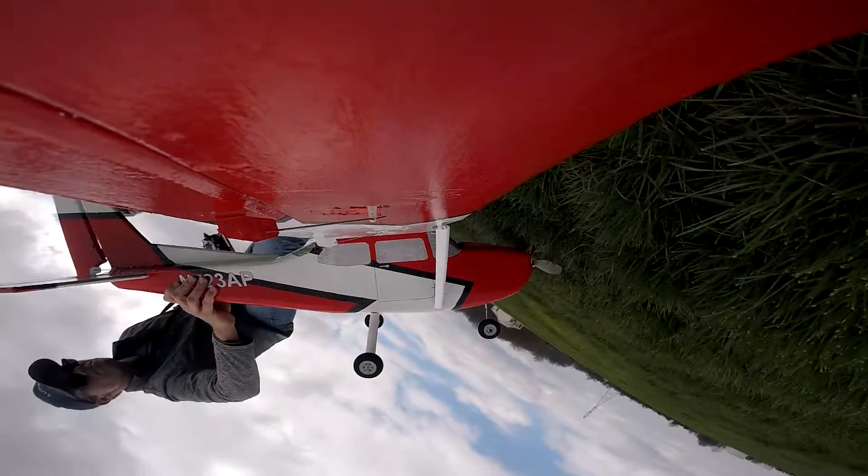With all that extra weight, the plane has to come in pretty fast to land even with the flaps down, making smooth landings trickier. But overall it looks pretty good in the air and flies decently. With the 5-cell battery, flight time was solid — I landed at about 10 minutes and the cells were all at about 3.8 volts per cell, which is pretty good. It had plenty of power and I was only using a 10-inch propeller. Thanks for watching — if you enjoyed this, please like and subscribe, and check out the build video!